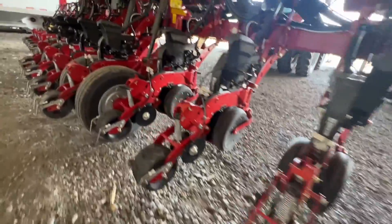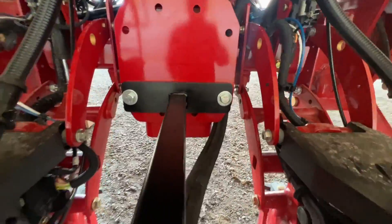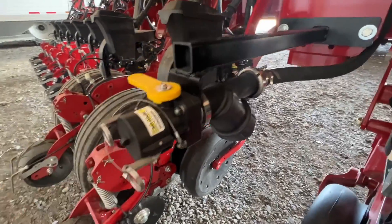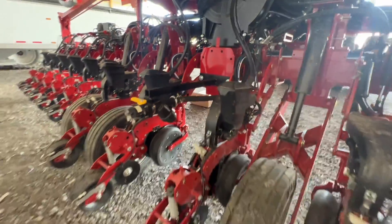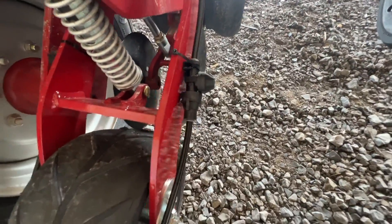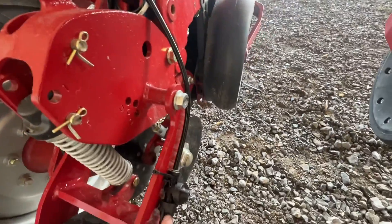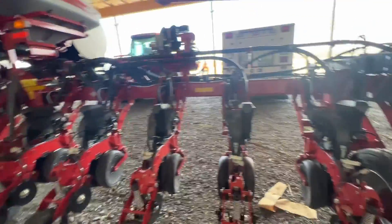We did the totally tubular out the back, putting it on both sides of the row. I really like that setup on these Case 2150s. We had to make a custom bracket for the fill — there wasn't really a great spot to put it other than that ladder. We came out the back for the fill port: two-inch fill with a cap. We have our check valves and orifices right here — those are what regulate flow, and we put our orifices after the split so we get a true 50/50 split.